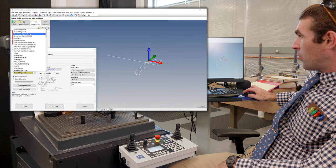The program ran. Looking at the report: we've got a perpendicularity of less than one thousandth, a flatness of four tenths of a thousandth, and a straightness of four tenths of a thousandth. Not bad for this square — probably more accurate than you need for laying out two-by-fours. It depends on how tight the hand wheel on the actual square is; it has a mechanical adjuster which I tightened down before putting it on the table.